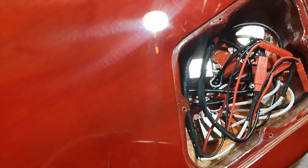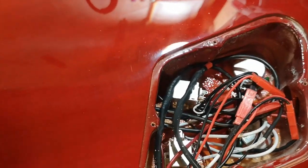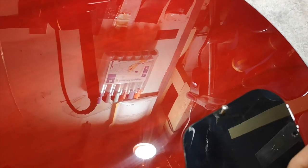And it's got quick connect thingies going on. Yep. Full-size pots, which is quite cool for a Chinese, relatively inexpensive guitar. But no shielding. So this is operating as a single coil at certain points in the game. So you might think of shielding that, and of course the inside of this plate. And if we were doing more work on it, like pickup swaps or anything, this kind of thing I would do. However, in this circumstance, I'm not going to pull the whole electrics apart to do that.